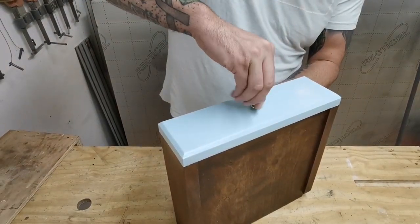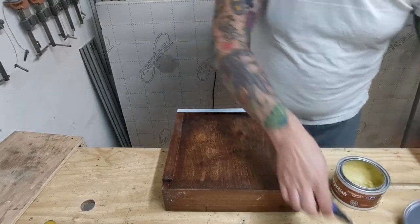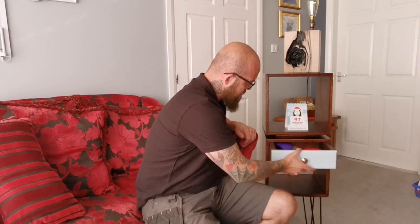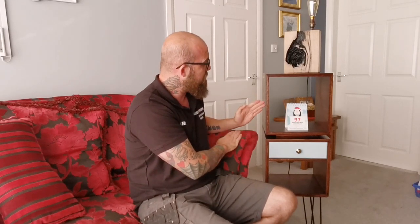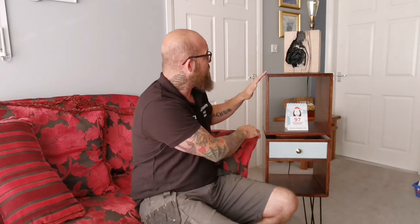When I took the tray over and slid it in and out of its space it was just sticking a little bit, so I gave it a really light denib on all the varnished and painted surfaces and rubbed on some clear furniture wax — then it was lovely and smooth. And that's the side table complete. Is there anything I'd do differently? Well, there was one thing I was a bit concerned about and that was the grain direction — it runs from front to back on all the sides of each box, and I was going to have it running around the other way. But in the end the deciding factor was the amount of reclaimed material I was working with. The pros are I've got nice clean mitre joints with no tear out, though there was a little bit which I fixed with super glue on the edges. But it's all turned out really well.